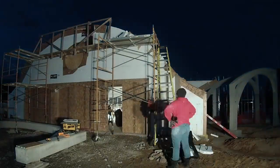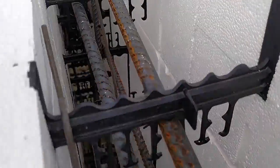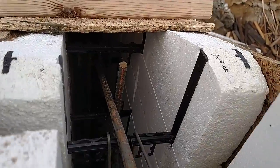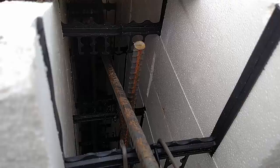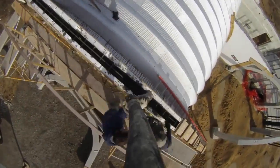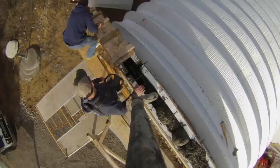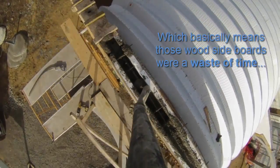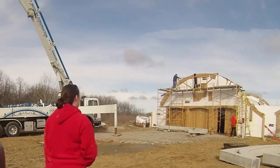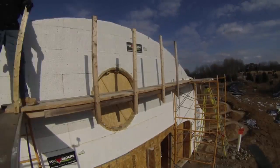This was the final evening before pour day, so lots of little tasks to take care of. Pour day — with the truck warming up in the background, here's a quick look inside the ICF blocks at the top of the wall. That black plastic reinforcement holds the rebar in place until the concrete is added to fill the void. Those metal clips hold the Fox Blocks to each other. Pumping began, but the mix was a bit thick with too low slump, so it wasn't going down into the void like it should. We drilled some holes to access and push the concrete vibrator in there. On this side we eventually ended up ripping off the wood for better access. While the truck was clearing itself out, I troweled off the wall. And then the final removal of the scaffolding.